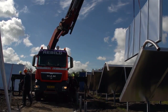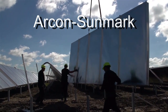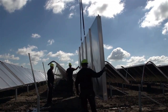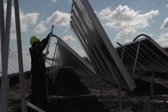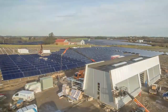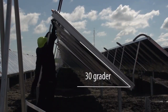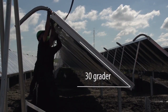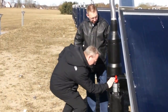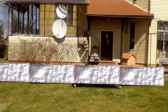Now I am showing the construction of a large solar station with expensive flat plate solar collectors. This is the work of the Danish company Arcon-Sunmark, which constructs solar stations radically cheaper than its competitors, and therefore this company is the world leader. It constructed almost all the large solar thermal stations, including this station to produce heat for a copper plant in Chile and this station for district heating of the Danish city of Silkeborg. We see workers installing large solar collectors on small steel columns, and then adjacent collectors connect with each other, and the edges of a collector row are connected to large pipes for heat transfer agent. This is just one section, and we must have many such sections which form a long roll like these collector rows.